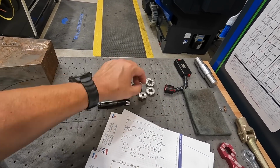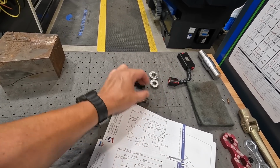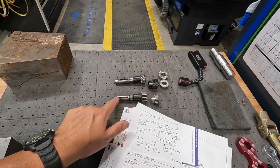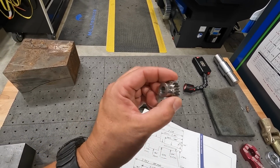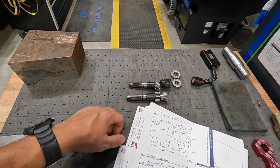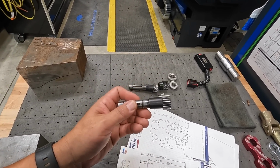They contacted me because they cannot get these pinion gears, and they've got some that have been damaged, and wanted to replace them. So they've actually got these gears here. You've got one that's helical and one that's a spur gear, and there's not a lot of torque on these things at all. So they just wanted to machine some new shafts where we can just install these gears and run with it.